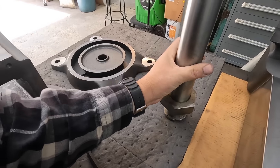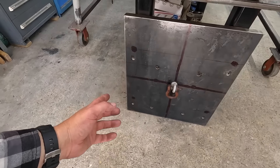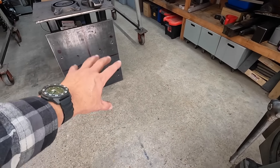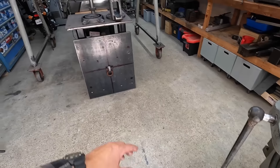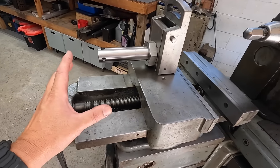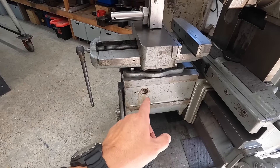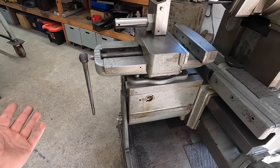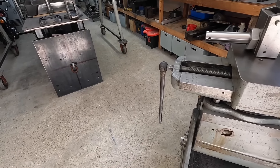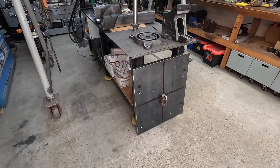As far as holding it, I'm going to be removing the big vise and using a fixture plate I made a while back for another job. It's already drilled and counterbored so we can bolt it directly to the shaper table, giving us a much larger work area. I'm going to get that mounted up, get the vise bolted to the swivel plate, and set it up here. I need to see where our bar is going to be so I can position it back here with plenty of room for the bar to go all the way through the workpiece. That's one of the disadvantages of the G&E's table size - an 18-inch table on a 32-inch stroke machine.